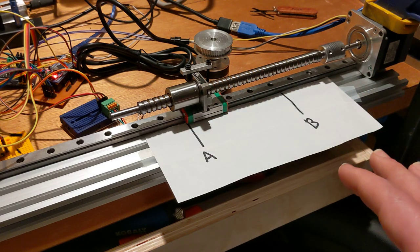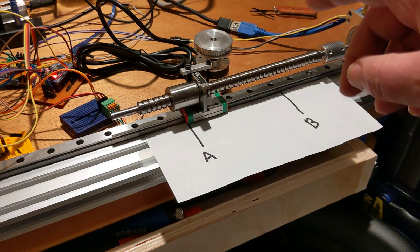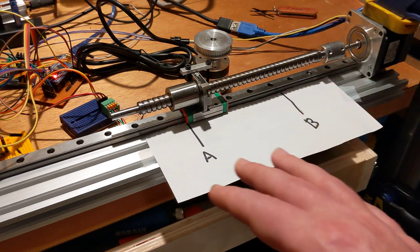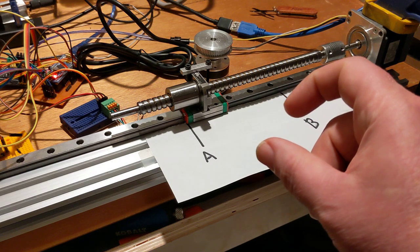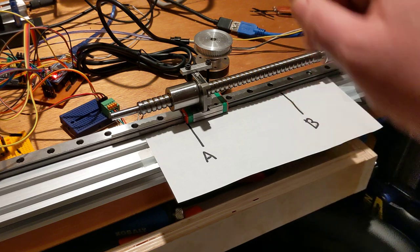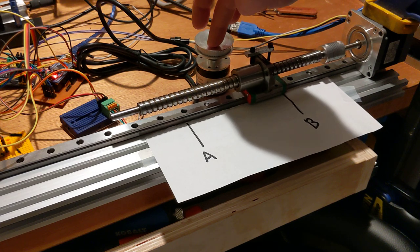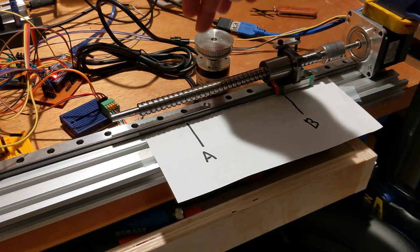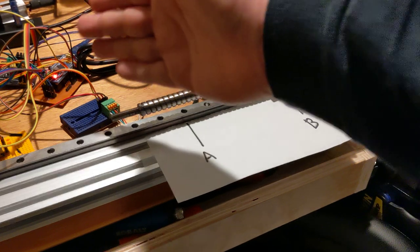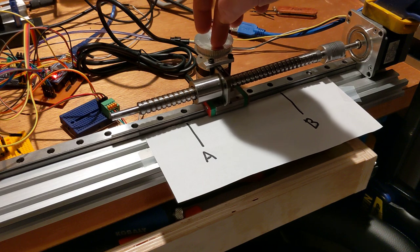I've tried to map out the math in such a way that I can see the latency curve, and theoretically, if I want about a half a second latency, I should be able to have steps that are 4 millimeters to get a decent latency. But I have half that. My maximum step rate is actually 2 millimeters, and when I get up to a high RPM, it's about a second of latency between when I stop, the jog cancel command issues, and the controller is actually able to get the motor to stop.